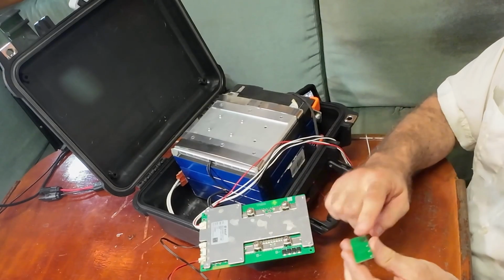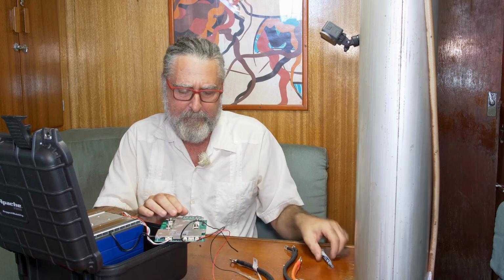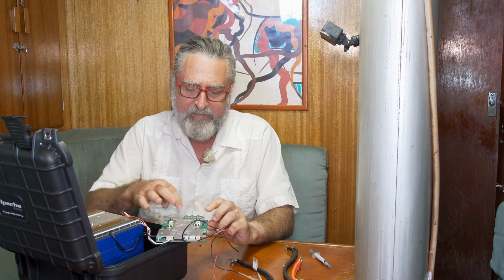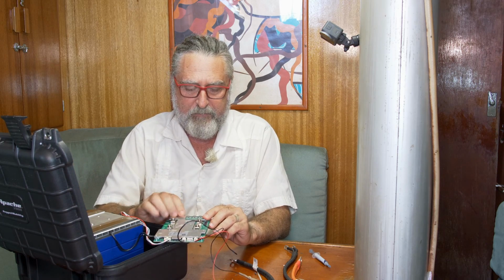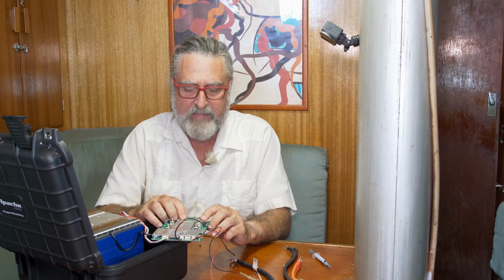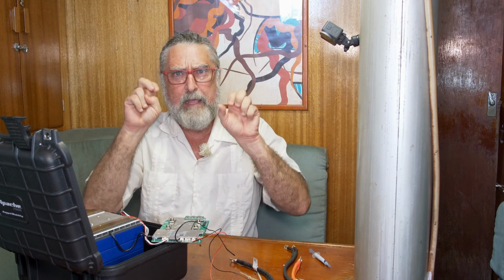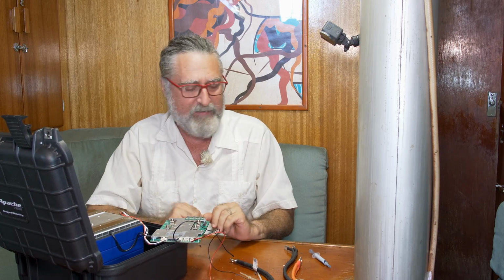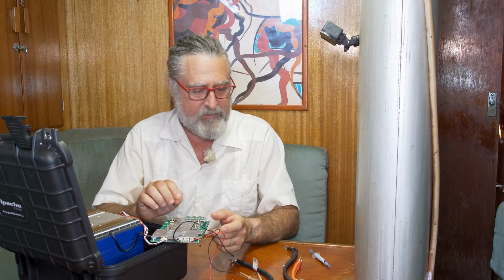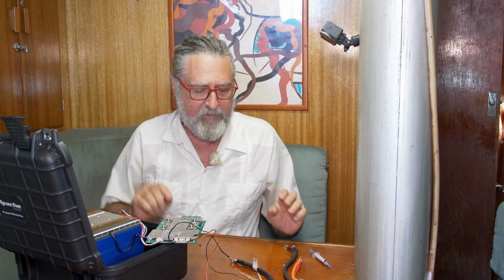The back of this board is all insulated. So I'm going to use a little thermal compound, and I'm going to basically borrow this nice big heat sink to cool these coils and transistors. And the way electronics works, the limit really isn't how many amps it can flow, it's how much heat it generates. So with this cooling, this thing could just go crazy. Again, experimental. So I'm going to physically mount this, and then I'm going to start soldering everything together.